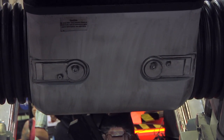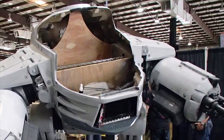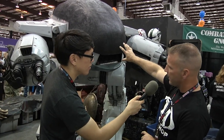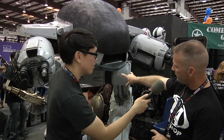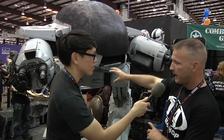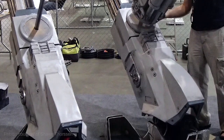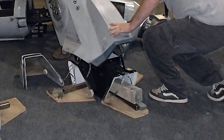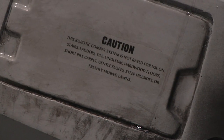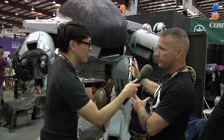How much does this break down for transport? All told, the dome comes off so we can get into the inside if we need to. The main body and shoulders are attached together, but I can pull the arms off on either side. The main body comes off of the pelvis section, the pelvis comes off the thighs, the thighs come off the lower legs. The leg from the cap down to the toe is one part, but the feet can be pulled off to break it into separate pieces. Underneath the fiberglass shells for the toes, there are a couple of lead bricks on either side that keep it from toppling over if somebody bumps into it. It is a little top-heavy, even though it looks like several tons of War Machine — it's really just a bunch of very lightweight shells.